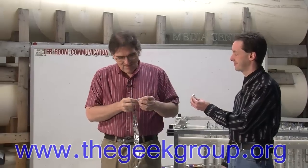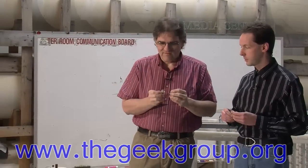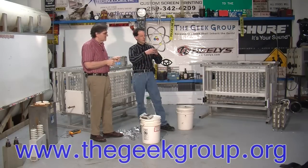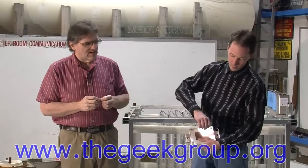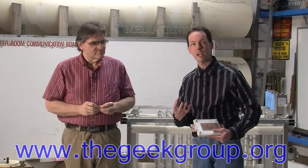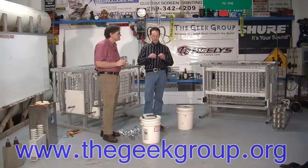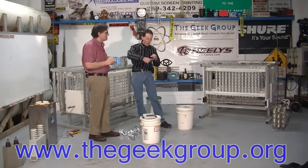Here's your ends. On this one, seeing they have the ends tied all the way along this length, there's almost no inductance in the capacitor itself, because instead of having to wrap all the way around, it's just the end. So you still end up with the very tight interleaving, only it's coiled around itself. It'd be like if you took this capacitor here and rolled it up this way, and made it a lot longer. You make this capacitor like 300 feet long and then just roll it up like this, and then all these come right out to one end and you have this massive electrical connection instead of just the little tiny thing. And by building it in this form, the inductance goes way, way down, but the current capacity skyrockets because all of this is directly connected.